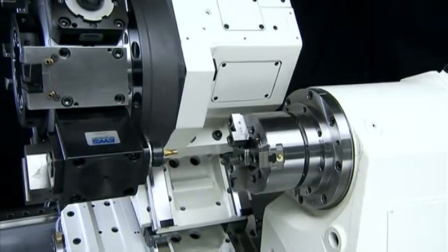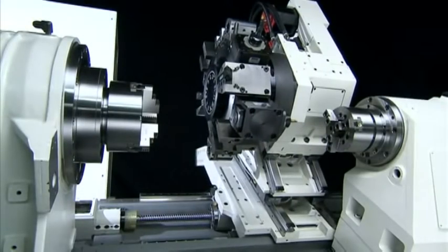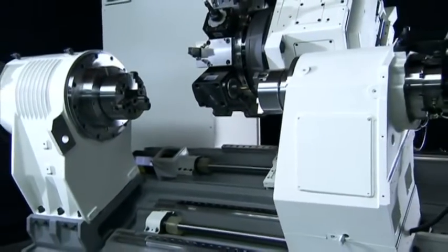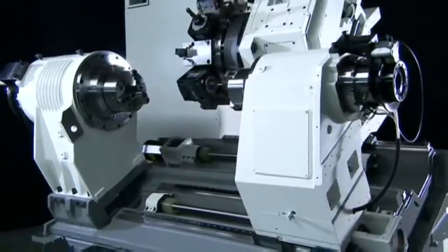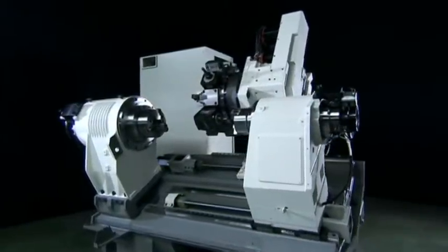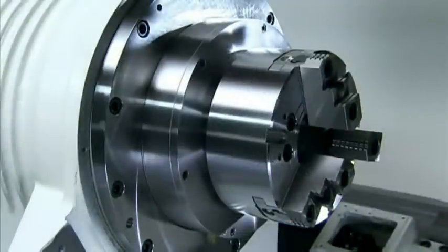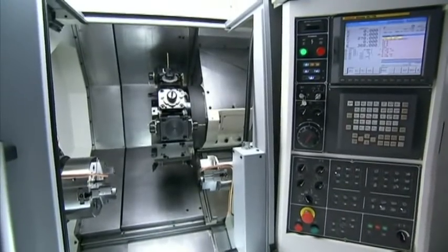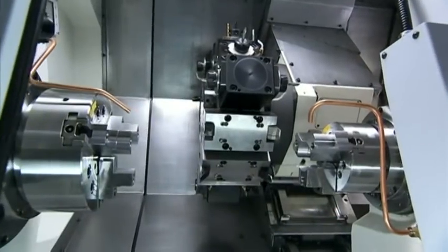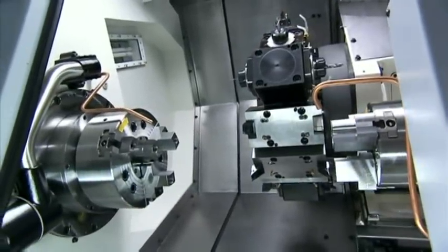The internal space design is also unique and allows for maximum flexibility in machining without any worries of tool interference. As you can see, this Fanuc dual-speed motor-driven spindle has a unique design with the direct drive motor built into the spindle housing, avoiding the need for an external motor and belt and saving you valuable workshop space at the same time. The spindle itself uses the very best NN type and angular bearing for very high precision even under heavy cutting load. This spindle also features an extra-wide 77mm bore for larger bar capacity up to 65mm.